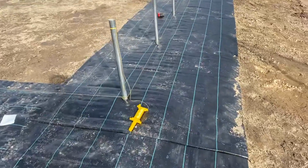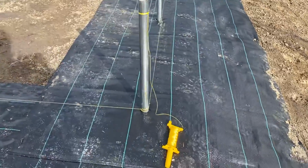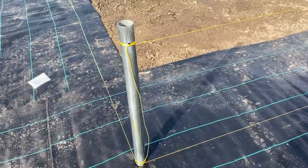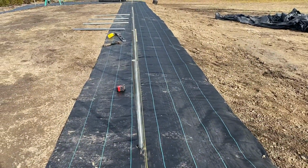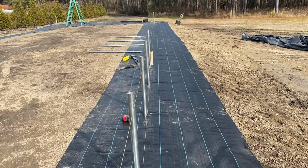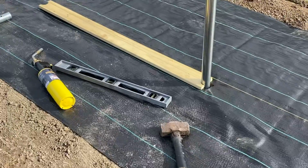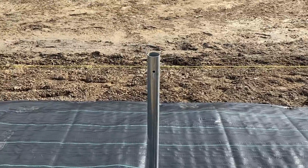We're back at setting the ground post. Obviously y'all saw the corner post, which is right here, and what I had done was ran 2 lines there and there, which will give me it plumb by touching the ground post at 2 points when driving them into the fabric this way. Then I have a 2-foot level to make sure it is plumb this way.